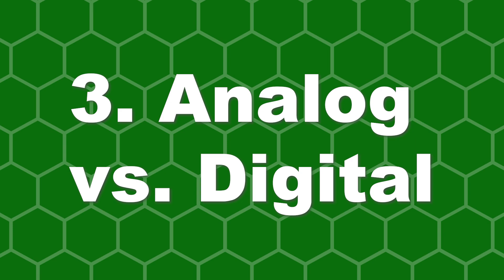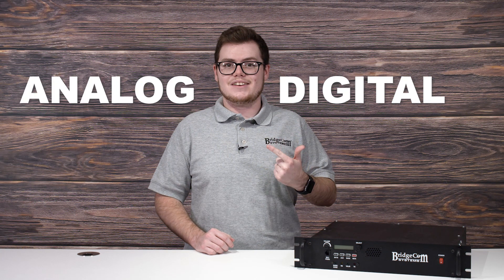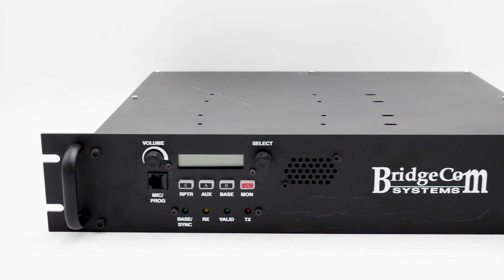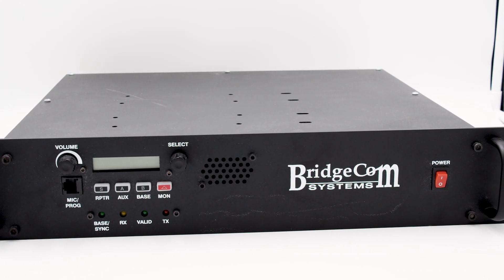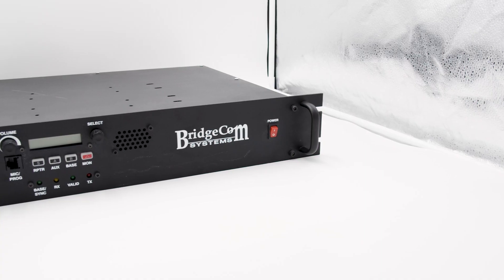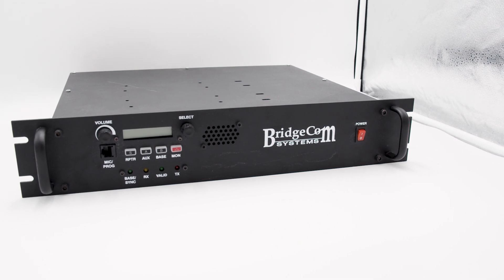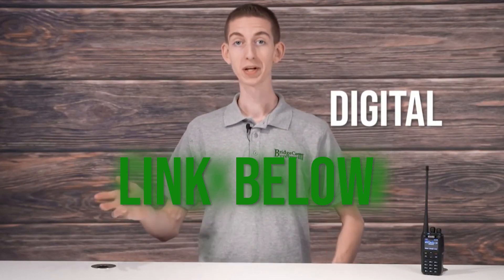Number three: analog versus digital. When choosing a repeater, you need to know what mode you want to use. Your two options are digital and analog. The main difference you'll notice between these modes is signal quality — by far the most crucial distinction. In an analog repeater, the receiver voice filters and sends to the transmitter via FM and/or AM modules, meaning you'll likely hear noise in the communication. In a digital repeater, the baseband processor converts the signal into patterns of numbers or digits, which removes signal imperfections first and then sends it to the transmitter. Only when the signal becomes too weak, whether uplink or downlink, does your call drop. There's a link below where we cover the specific differences between digital and analog.